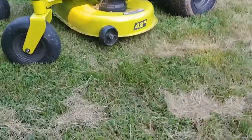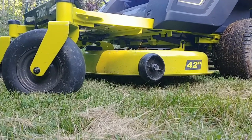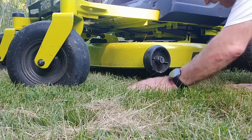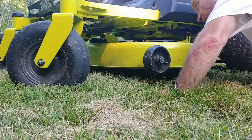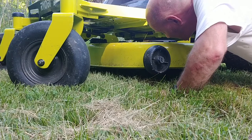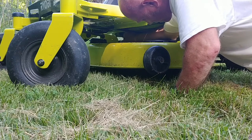You can see me pull this deck out — it's supposed to be pretty easy to do. You basically remove two electrical connectors and one or two C-clips. What's gonna make it difficult is trying to drag this out with that blade. I can see one clip there and one clip in the front. I bet there's gonna be another clip over there too, but let's just try it.